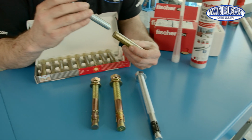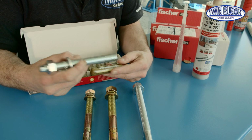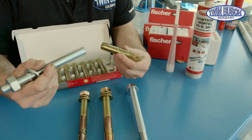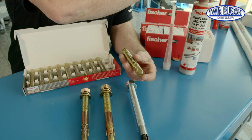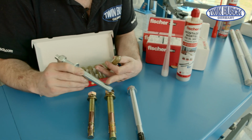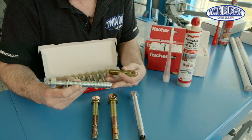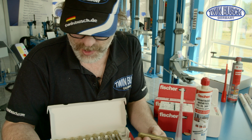Then the Würth anchor bolt is practically bolted into this system by striking. This cartridge bursts and the mortar spreads around the thread. However, I cannot control the amount of mortar I fill in each hole. This is the advantage of the cartridge injection system. I can control this system. I can press as much mortar until it is flush with the top of the hole. For me, that means that it glues all over the entire concrete surface. With this cartridge only this area with this one will be glued.